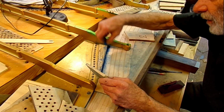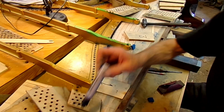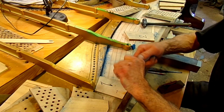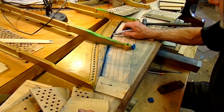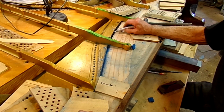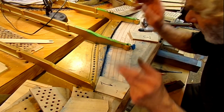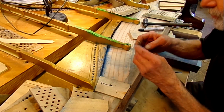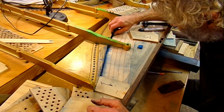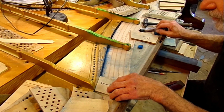And the chalk doesn't stick very well to the cast iron. We must first coat it with this. I learned this the hard way. Pick a cast iron and you put this stuff on here, this ink. And it gives the cast iron a texture for the chalk to stick to. And this is all messy. We're going to clean this up. Anyways, we take this chalk, this pool room chalk, and we chalk the surface. But if you don't do this, it doesn't stick to the cast iron. But if you do this, it just sticks so wonderfully. Oh boy, it's a wonderful discovery. Because you don't want to do this with any liquid. No graphite, none of that stuff.